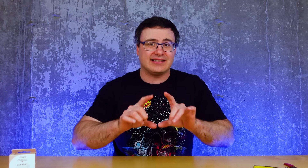Now that we've handled those two basic situations, it's pretty obvious that you need to make sure you have the space inside the electrical box. Chat with an electrician about how to fit everything inside the box in your specific case. In some situations you might actually have to expand the box behind the wall, or cut down some cables and deal with it in the future if you ever replace the relay. But let's go on to one of the most often used situations: those pesky garage door openers.